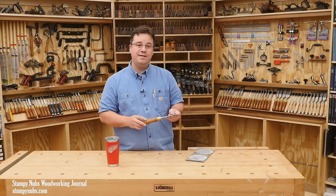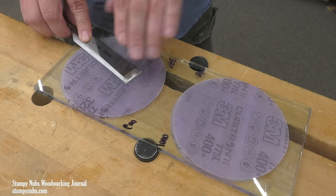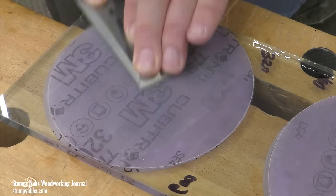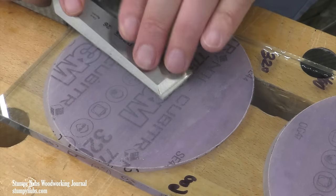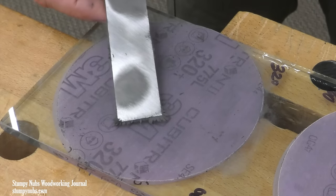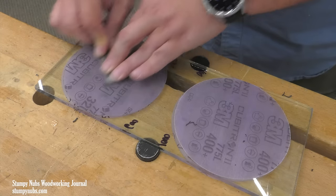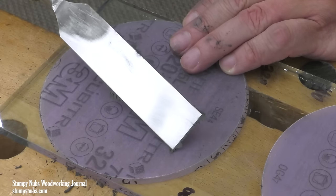I'd normally have to spend quite a bit of time on a tool in this condition, but watch what happens when I use the 320 grit Cubitron disc. I apply pressure at the end of the tool as I move it across the paper — I don't even have to lubricate it, it cuts fine dry. You can already see how fast it's removing steel because the metal is beginning to collect around the tip. Every 15 seconds or so I check my progress, and you can see the dull spot is beginning to shrink — much faster than with other sandpaper. If I feel the progress slowing, I can clean the grit with a gum eraser and get back to work. This chisel needed a lot of work, but I still got it finished in about 5 minutes. A typical chisel with a back in a little better shape than this would require even less time.